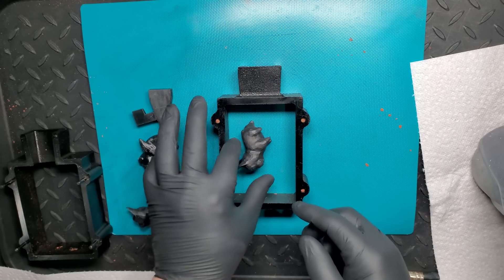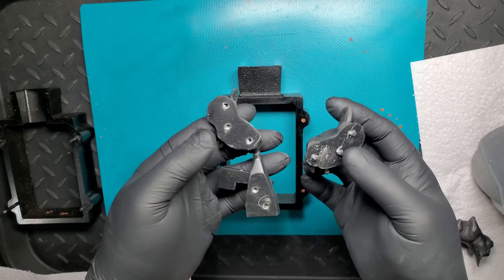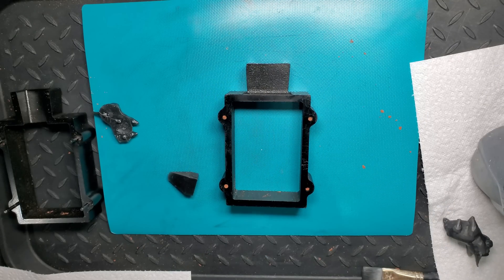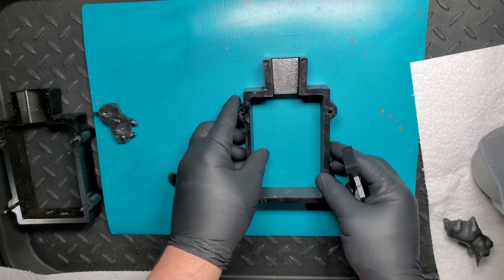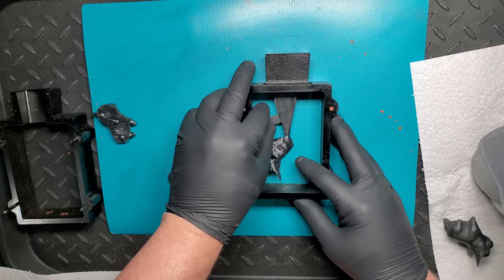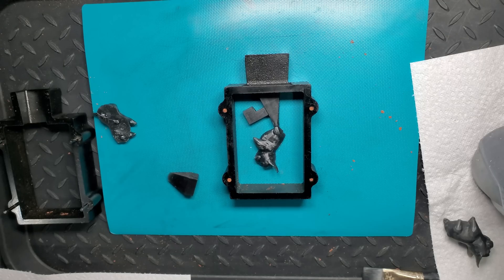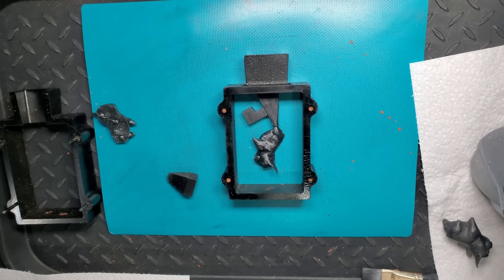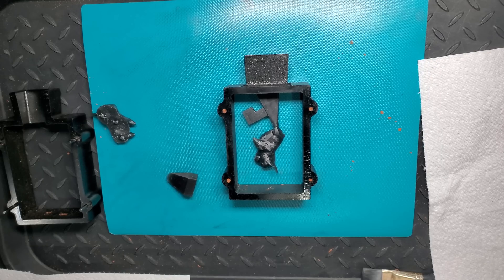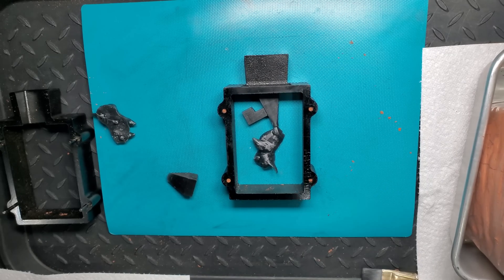This is where our experiment begins. We tried casting a small 3D printed French Bulldog figurine. While we get that going, we tried on the gloves. These are a one-size-fits-all, but it should work for the short amount of time you'll be wearing them. Something very important to take into consideration is that you will need a two-piece master of the shape you're trying to capture. Our original was a one-piece design, but since this type of mold requires a flat surface, we reprinted it into two halves to make it work. We also included in our two-piece print the pouring basin, sprue, and choke. You can see those pieces attached to the bottom of the figurine's foot — this is to avoid carving them out of sand.